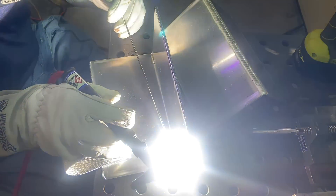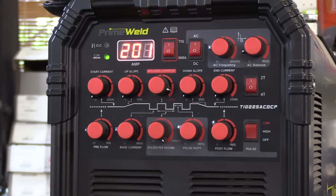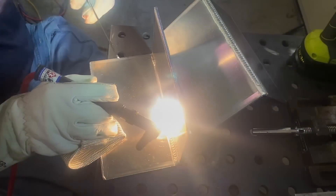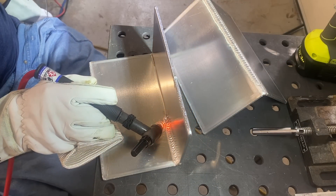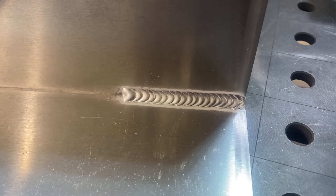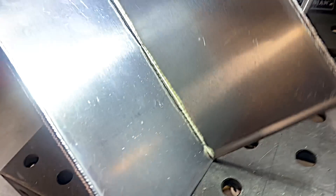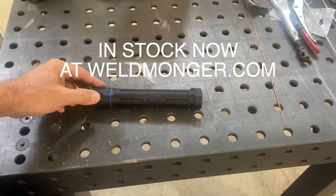Now I'm going to hammer the inside at 200 amps — the inside takes more amperage than the outside on a corner joint. This one's already been welded on the outside for the arc shot. I'm at 200 amps on this little PrimeWeld 225, and that electrode is handling it — not a problem. This is an example of why I recommend 2% lanthanated: it just has a lot of current-carrying capability. If I was using 2% ceriated, I'd most likely have to jump up to a 1/8 to do that inside, but 2% lanthanated handled 200 amps just fine.